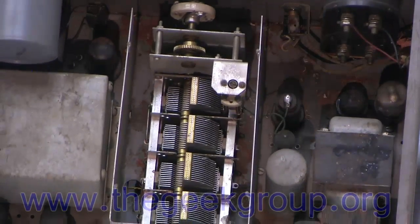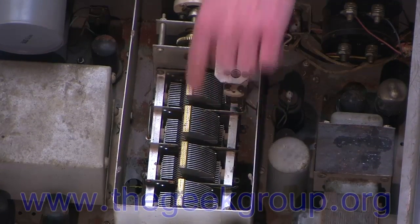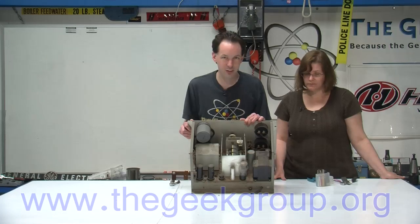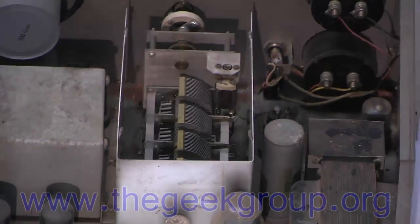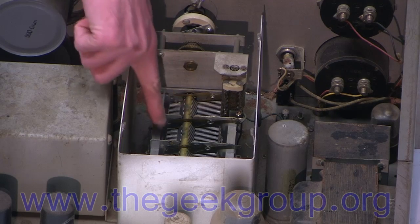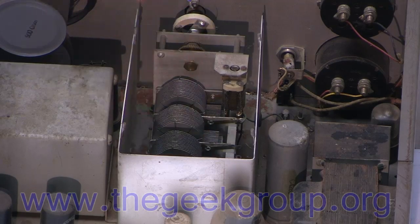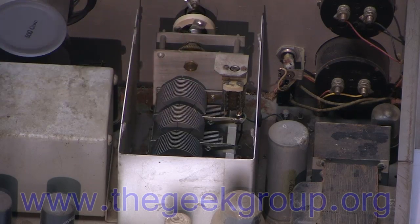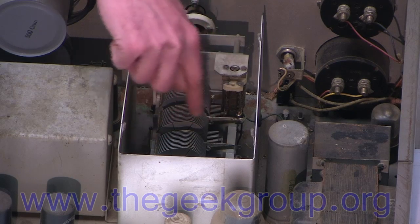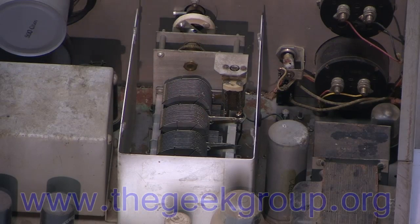Let's get a good look down in there. This is a capacitor — it is an air capacitor, and it is a variable capacitor, so they're usually referred to as an air variable capacitor. There's a set of plates here, and these are the rotors — these move. They mesh down inside another set of plates, and these are the stators — they don't move. These never touch those, and these are electrically connected to each other but insulated from those, so all the stators are electrically connected to each other. You've got two sets of plates.